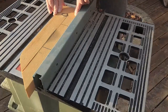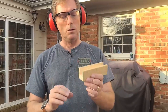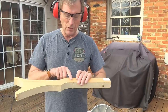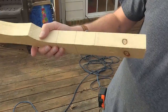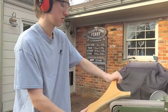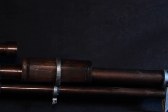Now I'm going to start to cut out that inch and a half by five inch piece, but I'm going to leave the top piece on so I can cut the grooves for the barrel first before trimming that piece off. There's our block — this is going to have to be sanded. You're not going to want to sand anything beyond this line. So now you're going to dish this in with the belt sander the best we can. I gave the job to Dylan. You're going to have to put some time into this — probably a good 30-40 minutes bringing it down, then hand sanding that surface. Also rounding that front part of the stock and putting the grooves in.